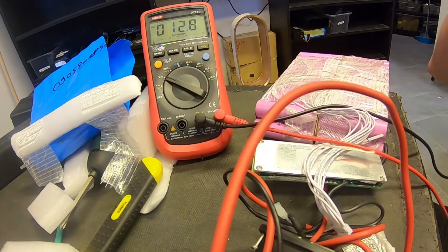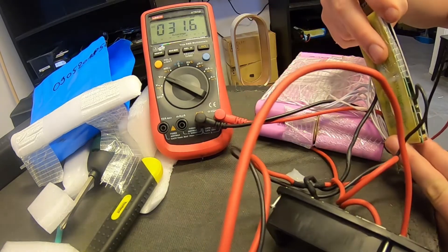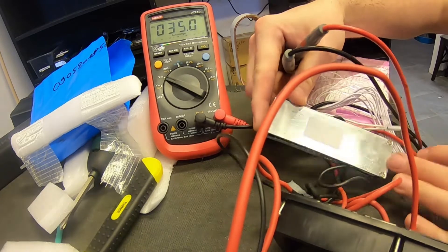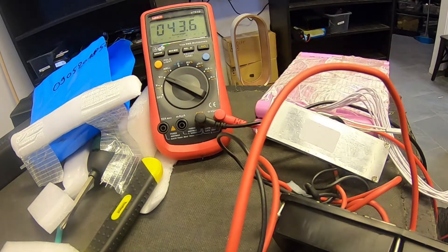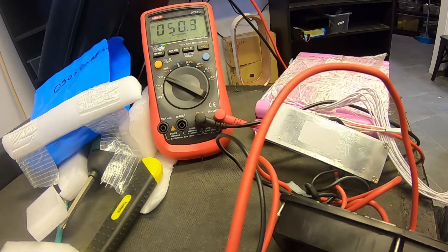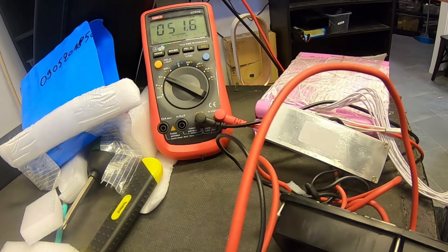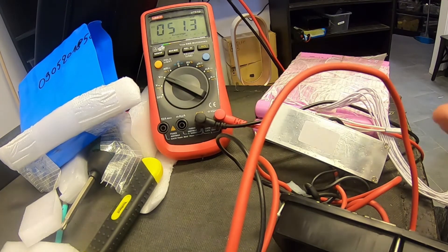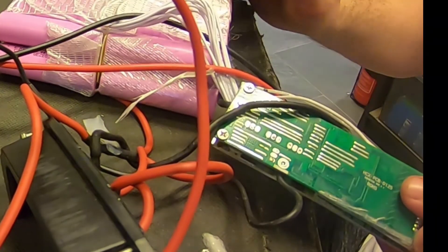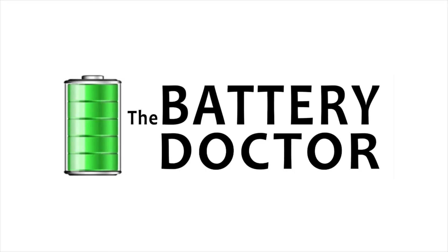There are shiny cells — nothing I will do with them. The BMS is connected the wrong way, and I don't know how many watts it handles — three or four MOSFETs, so it's like a 250 to 350 watt e-bike BMS. It has a large cooling plate so maybe you can get away with 500 watts, but we won't be using any of these. If you buy something from BikeBat, you're kind of screwed if they did it wrong like this. There is absolutely no reason to connect these wires wrong. It's not the poor board's fault that it was connected wrong — but so stupid.